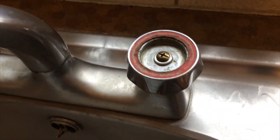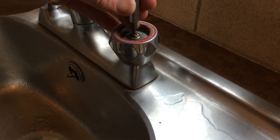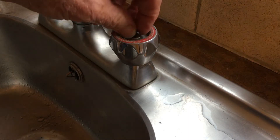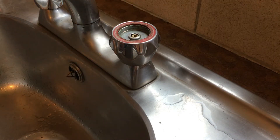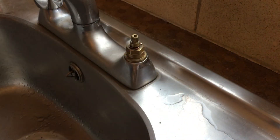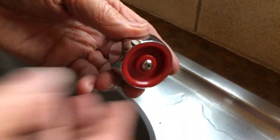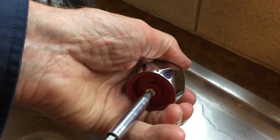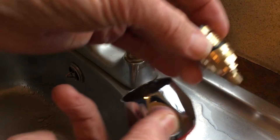Same thing on this side — remove the cap, get the screw, put the screwdriver in and remove it. Now if you wanted to change the whole shooting match on the hot side, you would need to isolate the supply, which usually means going in the airing cupboard and finding a gate valve of some description. Right, so here's a nice shiny new one — get your thumbnail underneath there, remove the Phillips head. This is such an easy peasy job — a real DIY job, a real Saturday morning type job. There's the gland coming out.